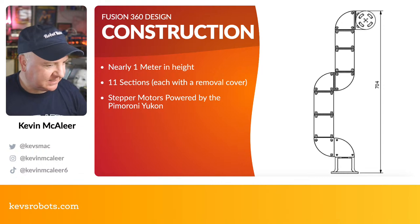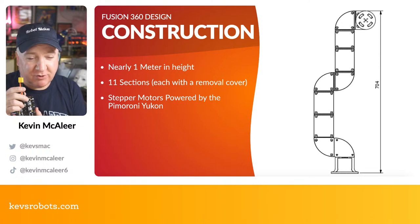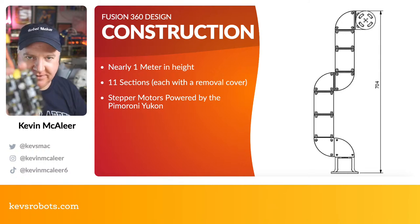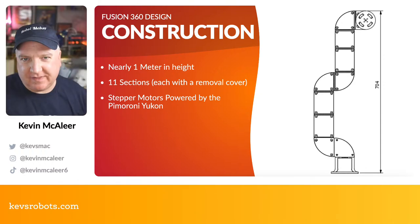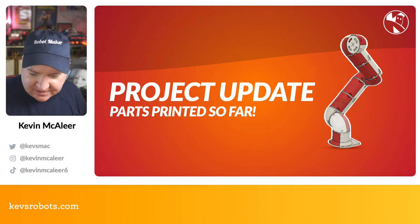And it's going to be powered, like I said, by a Pimoroni Yukon, because I really like these. It's great for powering projects that require quite a lot of juice, so these stepper motors are going to probably get quite warm because of the weight of the arm, but this can probably be good enough to provide the power that we need. It's also got safety, over voltage protection and all that kind of good stuff in there. Perfectly designed for stepper motors. And there's, I think, 11 sections in total there as well. So yeah, I'll go over now to the overhead camera.